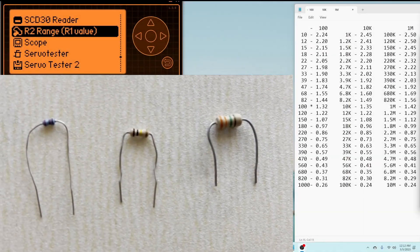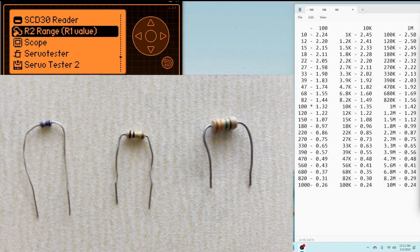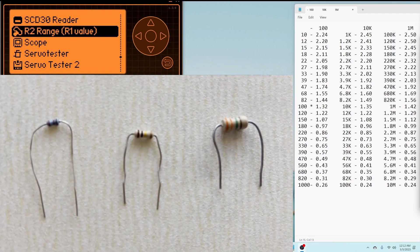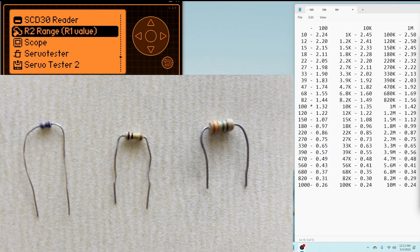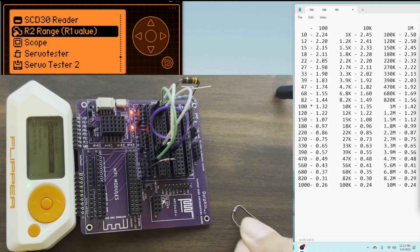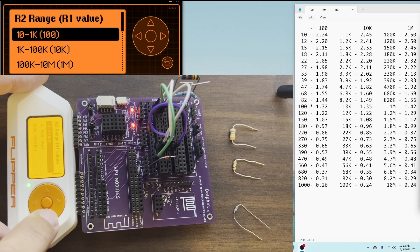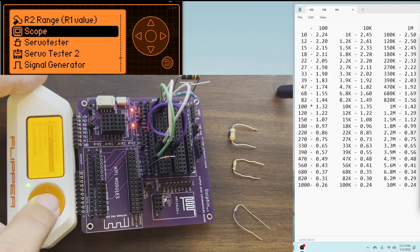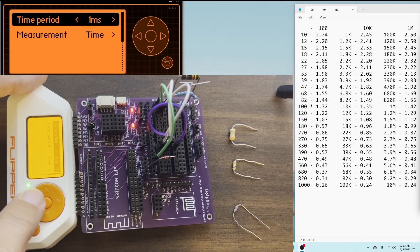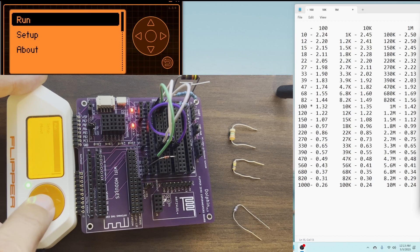Let's get started. Here are the three resistors that we want to measure — we'll start with the one on the left. I didn't write a measurement app since there's already an awesome resistor app being developed by Instantiator; hopefully it will be able to measure resistance someday. I wrote a small app that lets us pick if we want to ground R4, R6, or R7. So we'll start with the 100 ohm resistor, then launch the Flipper Scope application and set it up to display voltage as the measurement. This will display the min and max voltage at pin C0.